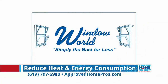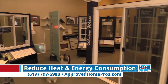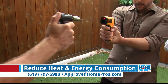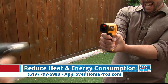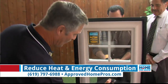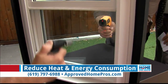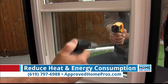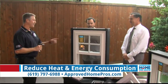Now this is where it gets really exciting — finally the torch. You're going to get about 600 or 700 degrees on this. I'm concentrating on keeping it right in the flame — the torch reads 69 degrees on the other side of the low-E window. Now we're going on the bottom again — the low-E argon pane. Do we need eye protection? You're looking at about 85 degrees on the inside. We've got 400 degrees almost right here on the torch side, and 85 on that side.